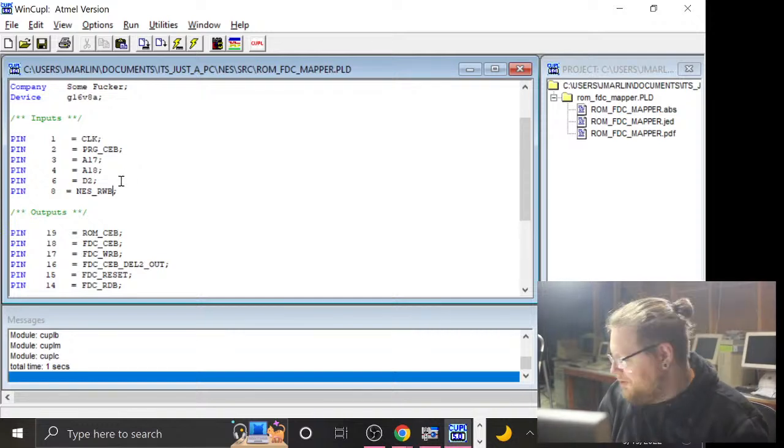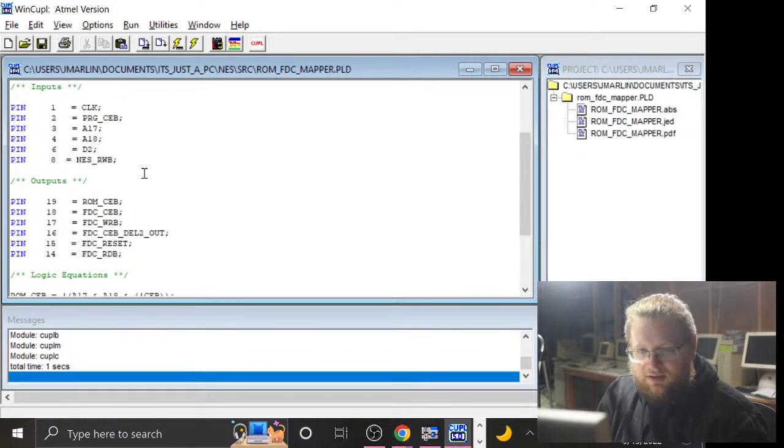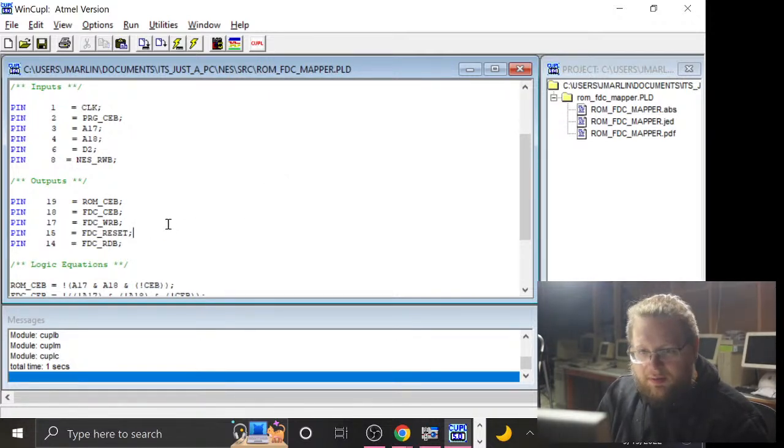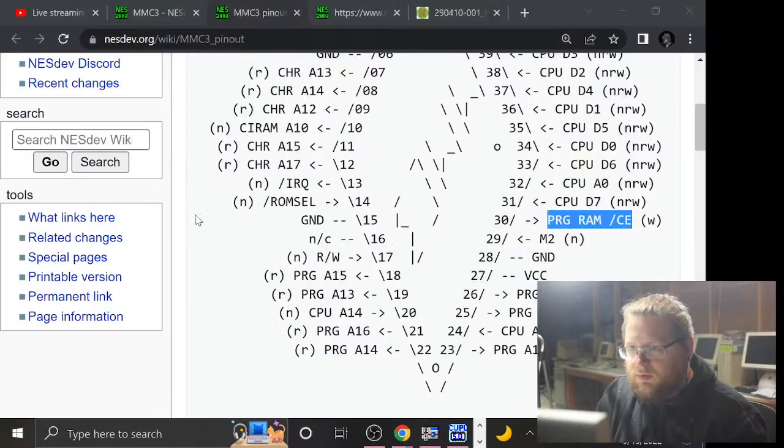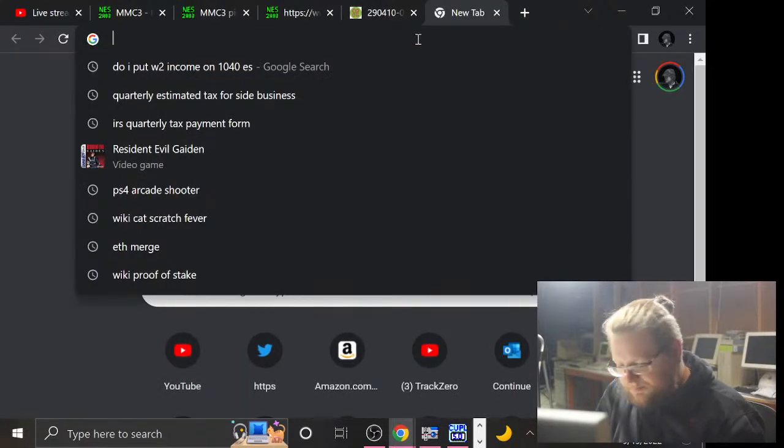But also we obviously need it to do reads and writes to our peripherals. So how many input pins do we have here again? I believe, because, for example, we had this delay for chip enable, but we do not need that anymore. So, might need to do some rewiring on the back of there. But I believe all of the pins on the right side of the chip, which are these pins, can be inputs or outputs. So, we can compare. Let's see how many we have left. Let us look at the data sheet for this again.